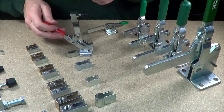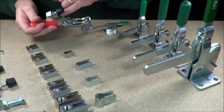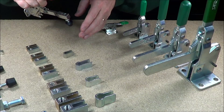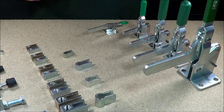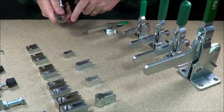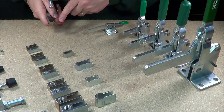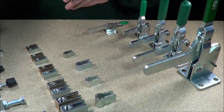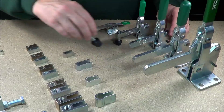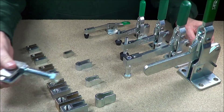The other thing that's really clever: if you are worried about them vibrating out, you can put in a lock washer right here, because this is a flat surface. Also the alignment — they're not loose. They stay very tight and in alignment very, very well because they're welded on. You can also use either a rubber tip on the end or a carriage bolt. When you see red, that's normally metric; when you see black, that's normally English. For these series of clamps, you just add these on like so — that's how easy they fit right on and you can weld them on. As you get into the larger ones, you might want a bolt because they're very rugged and very strong.